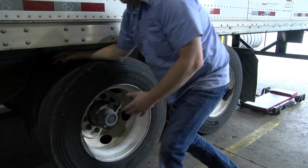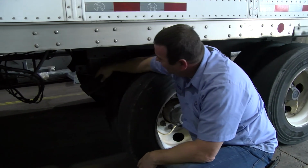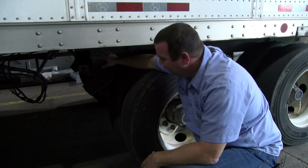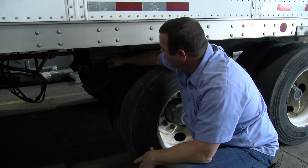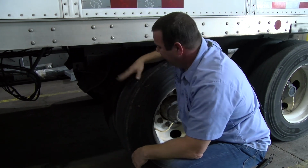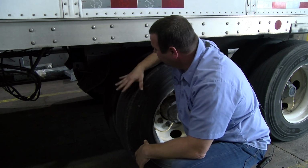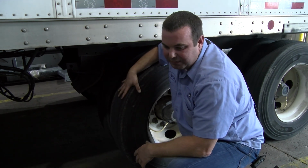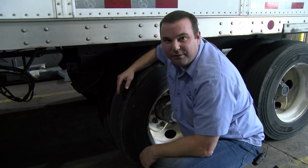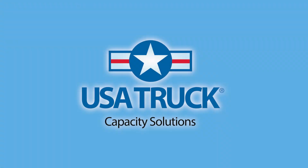You want to follow me over this way here. You're going to see the PSI box in the back section right over here. All right, and where all your air lines are coming out through. All right, and you spray those as well to make sure you don't have any leak. Now a lot of times if you're down here and you're really close to it, you're going to physically hear the air leak to where you don't have to spray. But again, we knew this was really low when we picked this up, so we just want to make sure that we're safe, and we're going to be DOT legal driving, so we want to check everything. All right, again, no nails or anything lodged into the tires is causing a leak, and all your lines are all set. All right, but that pretty much concludes the tire PSI system.